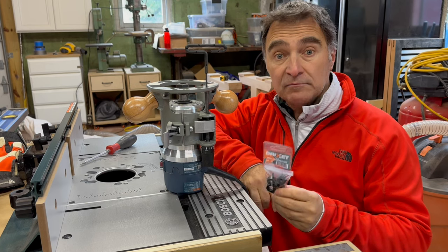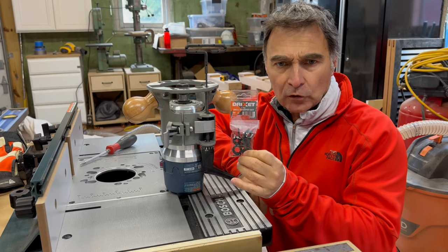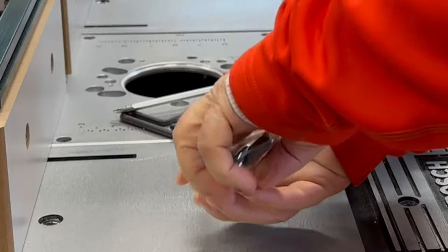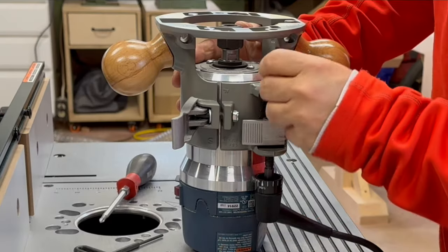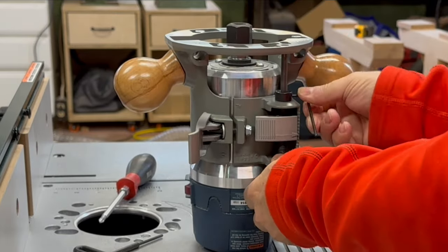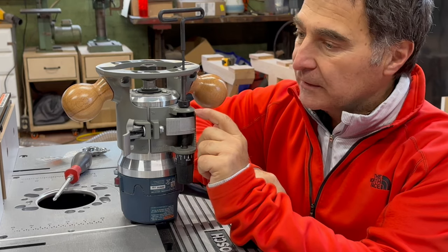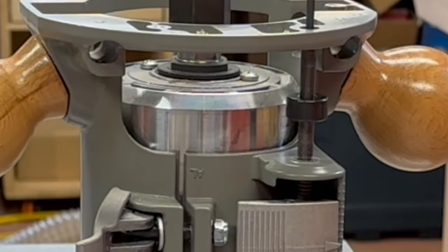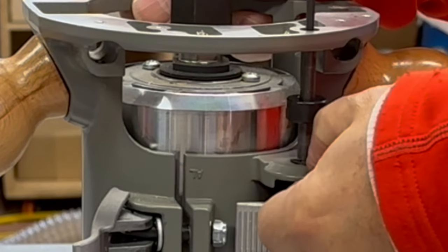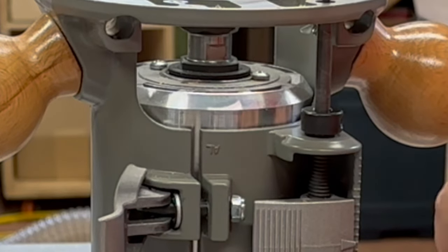I went on Amazon and found a kit of stop collars — it was $8 total with tax, just delivered this morning. This particular bit collar set came in sizes from one-eighth to one-half inch. I'm using the quarter-inch bit collar for this lifting rod. The bit collar tightens with the provided Allen key. After playing around with it a bit, what I decided to do was put the retaining clip back in and use the stop collar as a means to keep that retaining clip in place so that it won't pop out. I found that to be easier than fiddling with the adjustment of the stop collar to get the correct tension on this lifting rod.